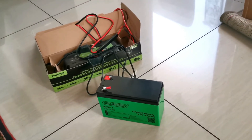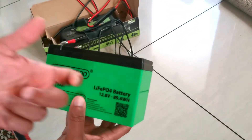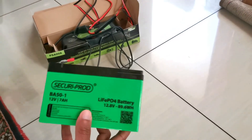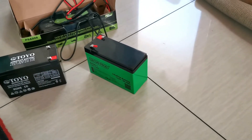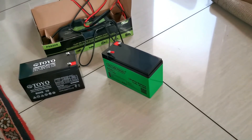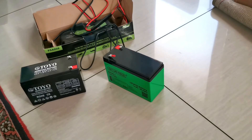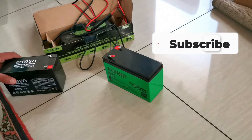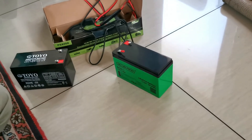From that perspective it's a suitable replacement, but it's about two and a half times the price of a regular lead acid battery. I'm going to go ahead and replace all my lead acid batteries with these eventually, because I estimate they should last at least six years, whereas in a gate motor a lead acid battery lasts about two years. Give it a shot — let me know what you think. Thank you for watching, and if you like the video, please subscribe.